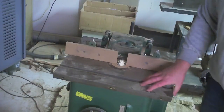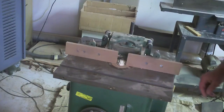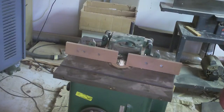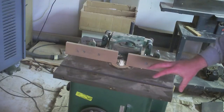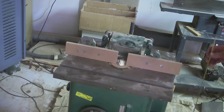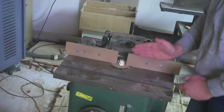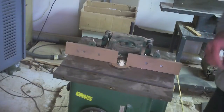Now, when it comes to using the machine, it runs basically like any other split-top adjustable shaper — it's really not that big a deal. However, I have noticed two additional areas that sometimes this machine, and others like it, can fail at. The first is that these fence extensions might not be completely 90 degrees to the table.